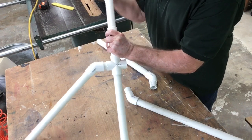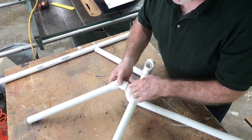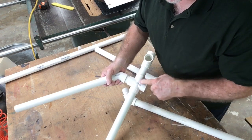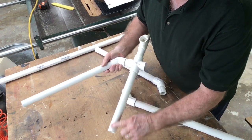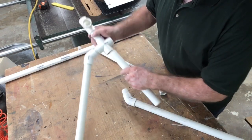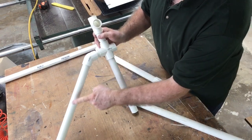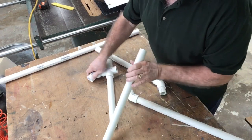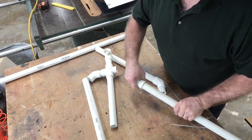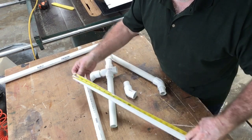As far as the dimensions, I'm using one-inch PVC pipe. The small pieces are 2 inches — you're going to need 3 of those. There's a 4-way fitting and a 45-degree fitting. You'll need 1 piece that's 12 inches to go into the 4-way, then the 2-inch piece, then the 45, and then you're going to need 2 pieces at 18 inches each. The long piece is 2 feet.